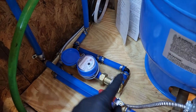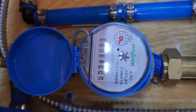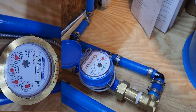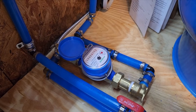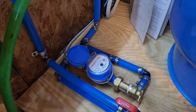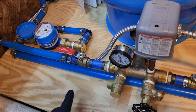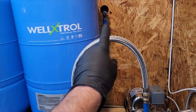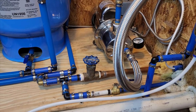The water comes down and over to this little water meter so I can monitor our water usage, which I think is handy. A word of caution: a lot of those meters measure in cubic meters, and you'd have to do a bunch of math — I didn't realize they had one that just showed US gallons, so keep that in mind when you order. Then the water runs back around underneath, all the way over to a hose bib for the outdoor garden hose, and also into the house into the laundry room — both with shut-off valves.